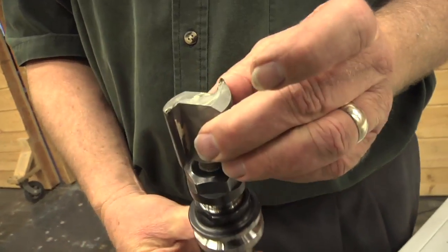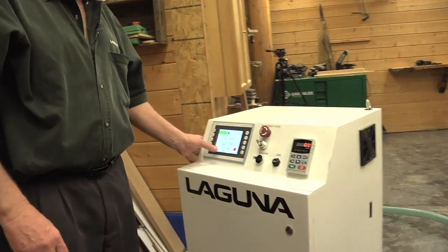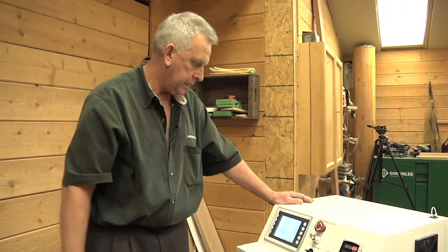This fly cutting tool is really just an inch-and-a-half diameter straight bit — I'm going to put that in the spindle. There are a couple of extra steps here, and this is kind of an exception to how you normally run a Smart Shop. Most of the time we use the automatic tool touch-off feature, but we don't do that when fly cutting. So first we go into setup under tools, find the second tool button, and there's a variable that says Z spoils. I'm going to select that and put zero for the value. Any time you change that value, go to the run screen and home the machine again so it calculates that in.